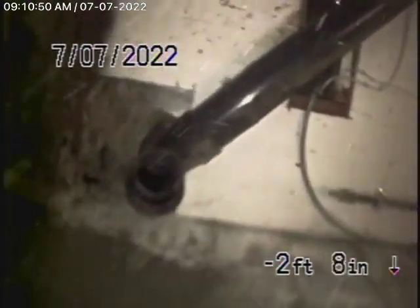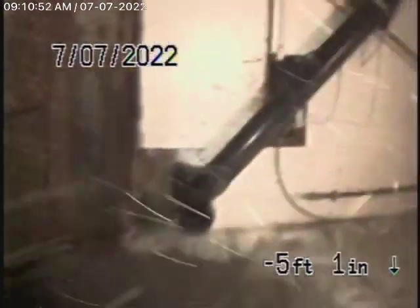Technically speaking, this wasn't really plumbed in correctly. Pretty much what should happen is that this ejector pump should be rerouted — the plumbing. That's what I would recommend, because it needs to be plumbed in properly with gravity feed. We'll go ahead and stop the recording.